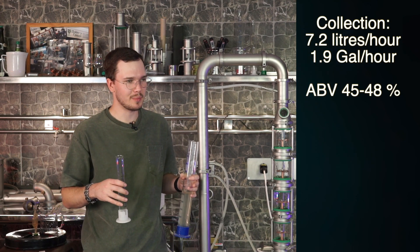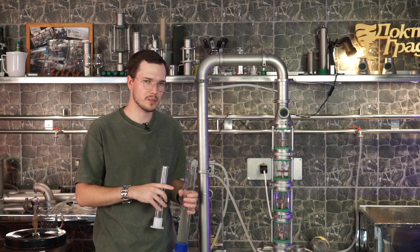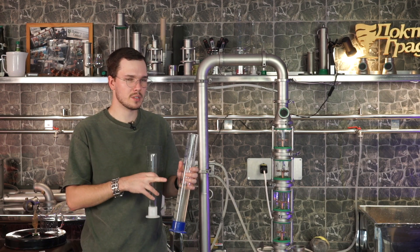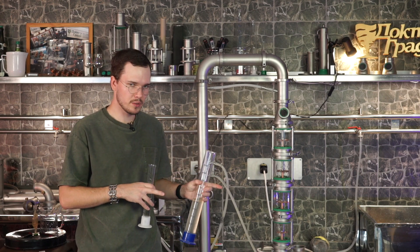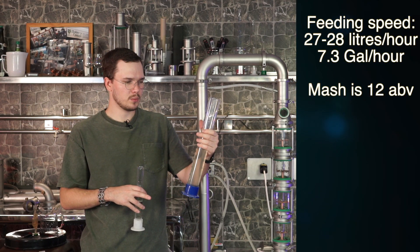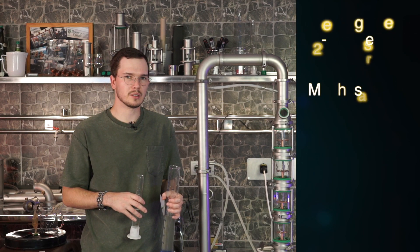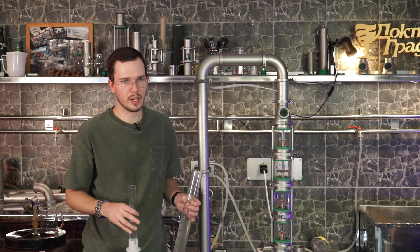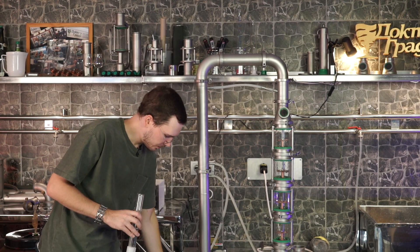We're getting about 60ml increments, so right now we're having pretty good results — not really efficient for the three-inch because with stainless steel pipes with plates and isolation you'd get even more. But anyway, it's interesting to see what's going on in the column. We're having 7 liters and 200 milliliters per hour on these adjustments, ABV is 45%. It's only a stripping run — we don't really make continuous stills for the spirit run. Right now we're feeding our continuous still at a speed of 27-28 liters per hour, and the mash is 12% ABV. Super clean and high proof.